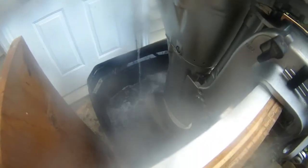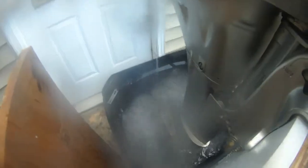Neutral. And forward — forward is even more powerful. This is neutral. You can see the water is clean after the impeller change, and the water is very cold to touch. So the thermostat is working correctly.